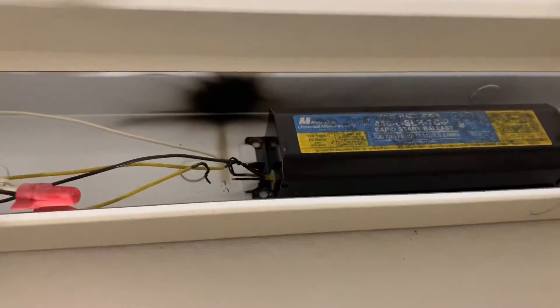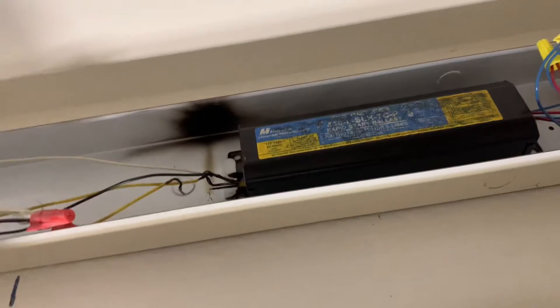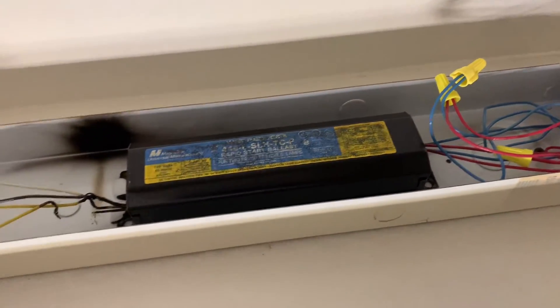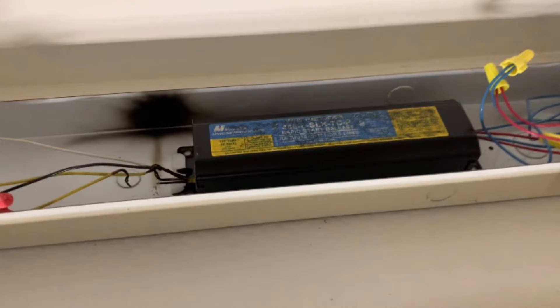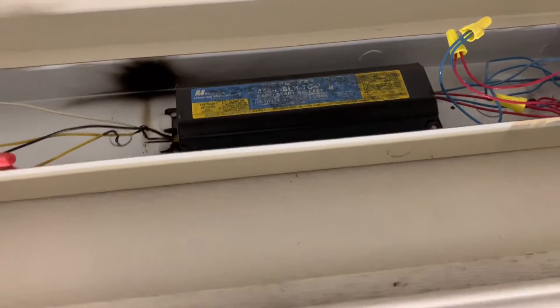This is like a fire hazard. Even with the burnt wires, this should have tripped the breaker. These ballasts can act like a fuse, but they are known to carry a lot of electricity to the wires, and when these wires have load they can get very hot.